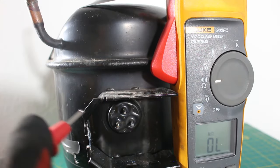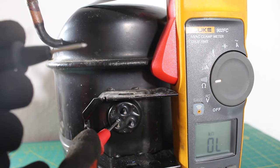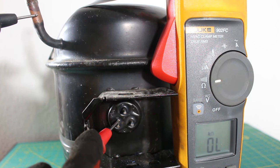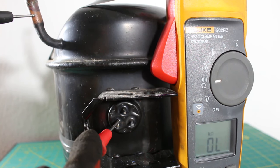For this test, we're always going to have one lead on one terminal, and then your other lead is going to go to a ground — I like to go to the copper that is connected to the system. To get a better reading, you might want to sand down the copper for a more accurate result. Here you can see we have no continuity, no audible sound, and we have an OL reading — an open line. That is actually what you're looking for.